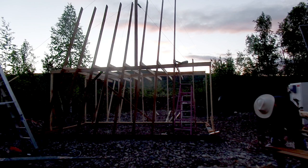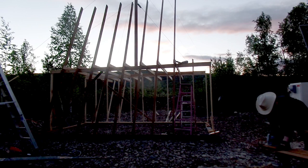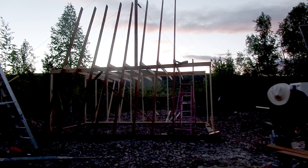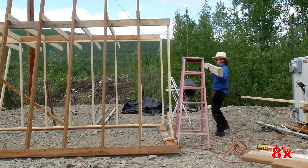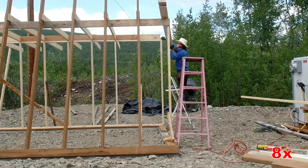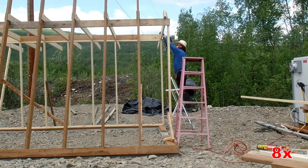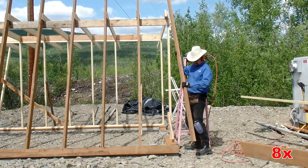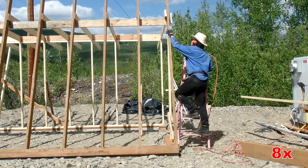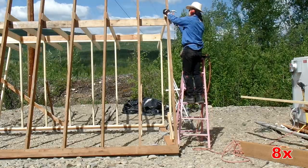Here's how I was cutting the spars - I basically made a little template, grabbed my skill saw and just chopped off the end so it's at the right angle. Then it's just a matter of wrangling things over and sticking them on there. Here's the final joist on one side - I measured the position of the joist so the front-back distance should be pretty constant. Sheathing is going to go on the outside so it's kind of a weird gusset there - it's a full two-by gusset.